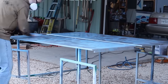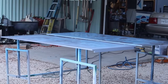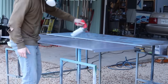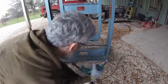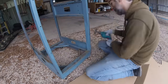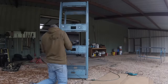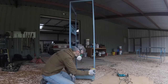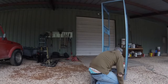Once fully stripped back, I hit the panels with some wax and grease remover — except I don't have that, so this is just brake cleaner. Once clean and dry, it's time to coat everything in some primer — just flat gray Rust-Oleum primer in a rattle can from any hardware store. While that dries, I work on stripping the frame itself, which is much harder because of all the complex shapes. I opt for a drill with a wire brush since I can't get the orbital sander in most spots. The brush tends to fling little metal strands at your face, so safety third and all that.